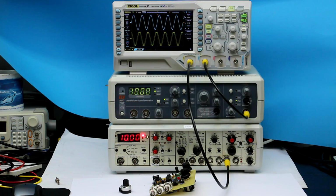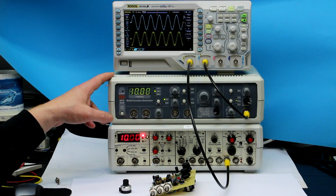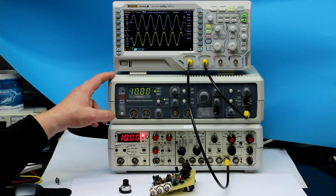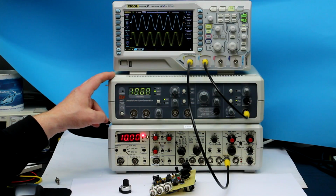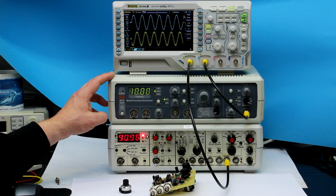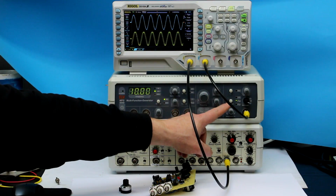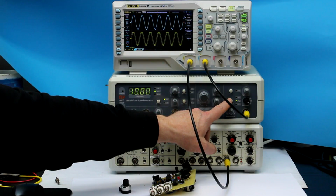And that was the reason why for quite some time a lot of Maxim chips were not available, and they never resumed fabrication and producing new masks for the MAX038, but you can still get them on eBay and other sources. Why is this chip so famous? Well, it goes up to 20 megahertz, and it's a much improved version of the old Intersil ICL8038 or the comparable XR2206.